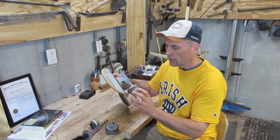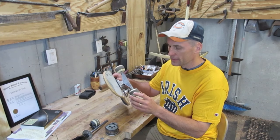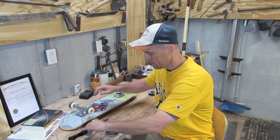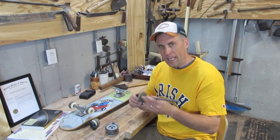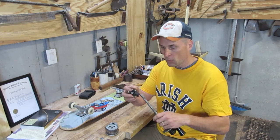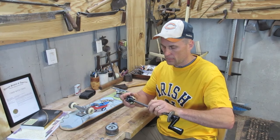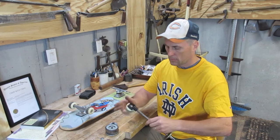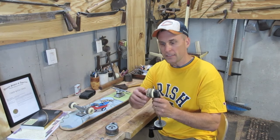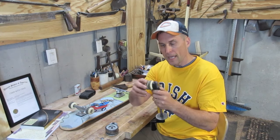For the idler itself I wanted a wheel that was lightweight and turned easily, so I used a skateboard wheel. For the adjustable portion I had this screw that already had a handle on it and another piece that went with it. It's pretty easy to mount the wheel to the piece, and now this can be adjustable.